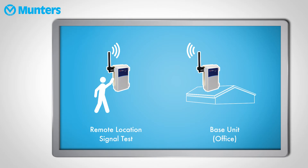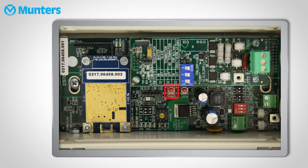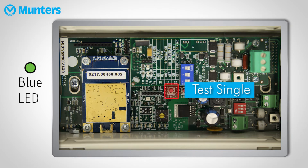That's it. Almost. What I didn't explain was how you know where to place your remote units. Here is where R-Link 1 has the biggest improvement. Instead of having to install the units, connect them to the controllers and communicator and then test the signal strength, you can generate a test signal before connecting the R-Link 1s to anything. Set the base unit as explained — nothing changes there. Press the config button for 5 seconds. This starts generating a test signal.